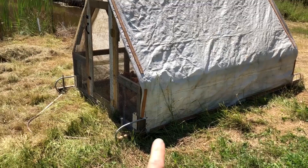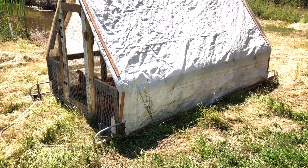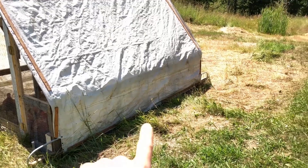The next readily evident improvement is these skids. They are half-inch EMT conduit, just like what's used for the roof, but made to go under the entire length of the tractor and then wrap up and attach to the frame. Here's the finished product with the full skid installed.